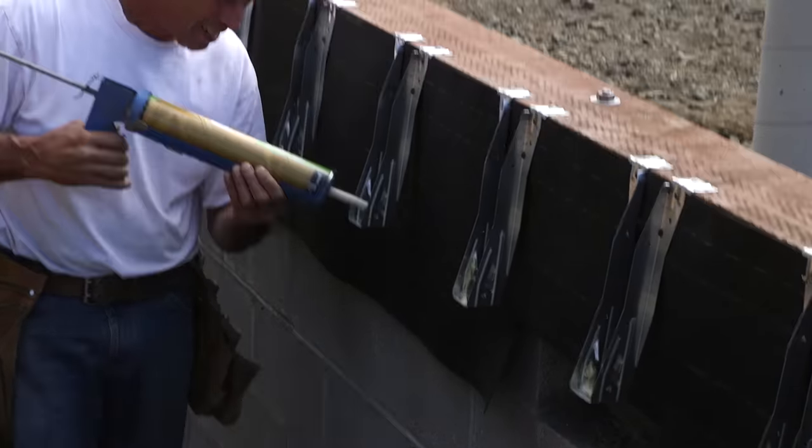Now, nails are great fasteners, right? But every time you put a nail vertically through your decking into a joist, glue or not, you're setting yourself up for a possible squeak. So I'm going to minimize the use of nails. Some will be necessary in installation, and concentrate on screws for holding down the overwhelming majority of this subfloor system. A screw, if it doesn't break, is not going to squeak.